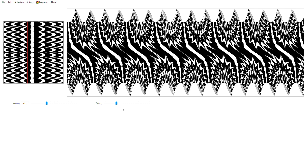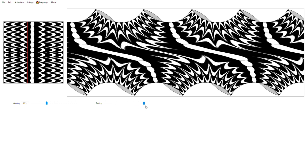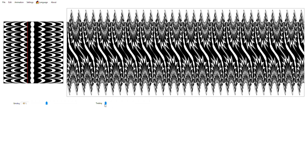This one is called Ws1 — a basic 12-layer Ws pattern. We can alter the twist rate. At low twist, the Ws aren't bent into much of an arc; they're bold, coarse, and there aren't many per inch. At the other extreme, if you really twist the bar, they get very sharp, spiky, and bent, with many of them packed next to each other down the bar.